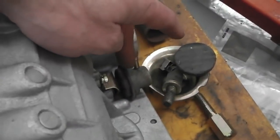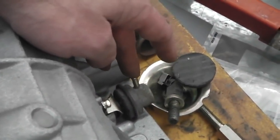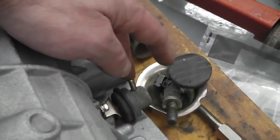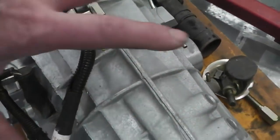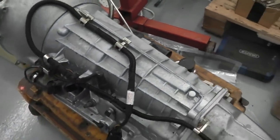So that's a vacuum diaphragm. As I decelerate or let my foot off the gas, the vacuum increases because the throttle's closing and there's more vacuum available on tap, and moves a pin in here which opens various valves in this, and that's another science, but that tells it when to up or down shift.